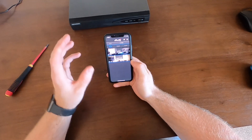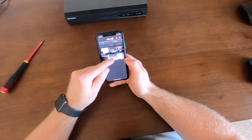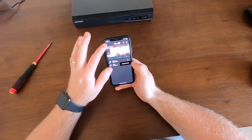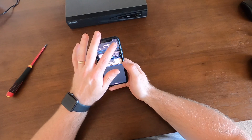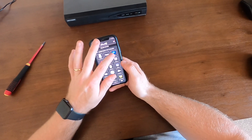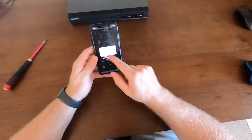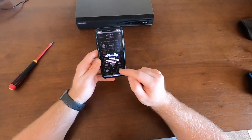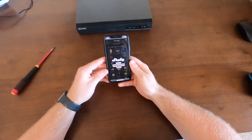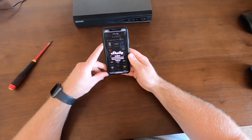We need to plug it in and head over to the Shelly app. As you can see, we've got the existing lights - the garden ones aren't connected yet - and the front up-and-down light is offline because I've taken it off ready to install. Back to the home page, we need to add a device. Your internet details are already on there, so click next and select the device we're connecting. We've clicked Shelly 1. Note: this doesn't always work first time - it sometimes takes two or three attempts.